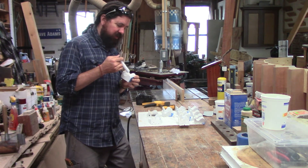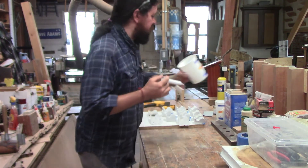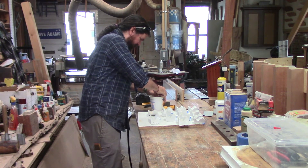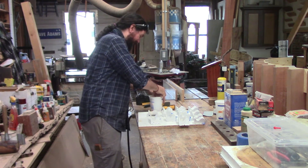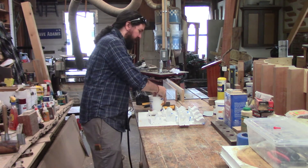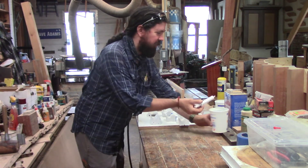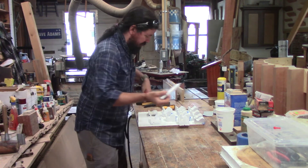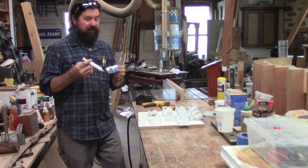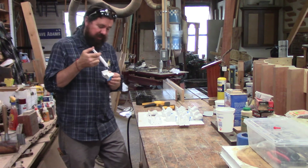That deterioration around the nails must have to do with the metal sweating. With the syringe technique, it's working really well. Because of the quality of the wood inside of the nail hole, it is taking three or four passes. By the time I make my way to the end, the first hole shows no signs of epoxy inside it, but with the last ones I did, it was about four times around before the epoxy was on the surface.